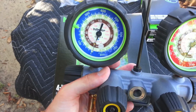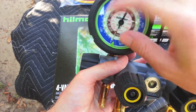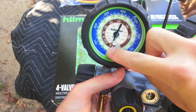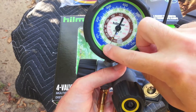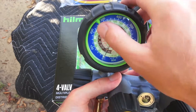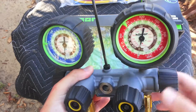What I like about this set is it has a pressure reminder. If you're doing a nitrogen pressure test, you can set your pointer to the needle on the gauge so you can reference it later and know if there's a pressure drop or rise — if you have a leak in the system. Same thing on this side as well.